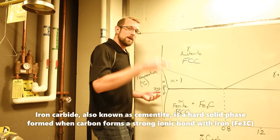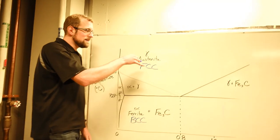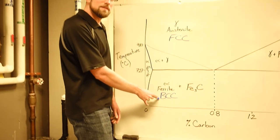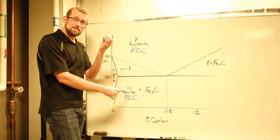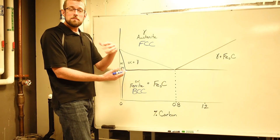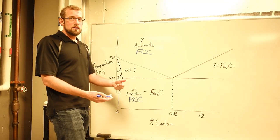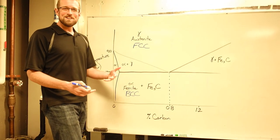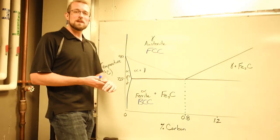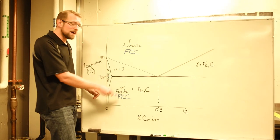But cooling it quickly, raising it to a high temperature, dissolving my carbon, and then cooling it quickly down into the BCC zone, that forces my carbon to stay stuck within the structure, stretching it all out, and making it extremely, extremely hard. There's a bit more detail to it than that, but that's the basics, saying that my quenched steel becomes extremely hard because of that transformation.